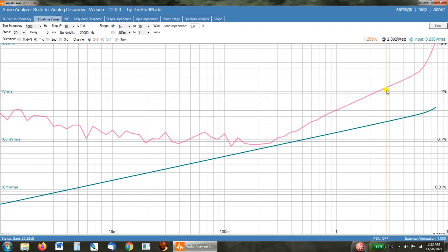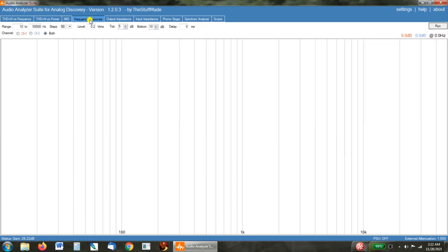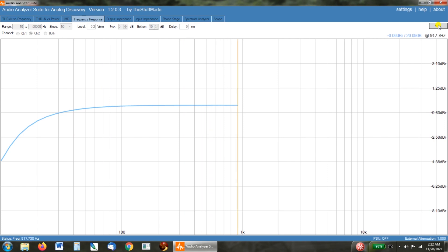So let's go look at the frequency response and switch back to the unmodified channel. Just like before, it levels out at about 100 Hz. When we get down to 40 Hz you can see it's already dropping off — it's not strong in that area. And then it starts rolling off on the top end at about 5kHz.